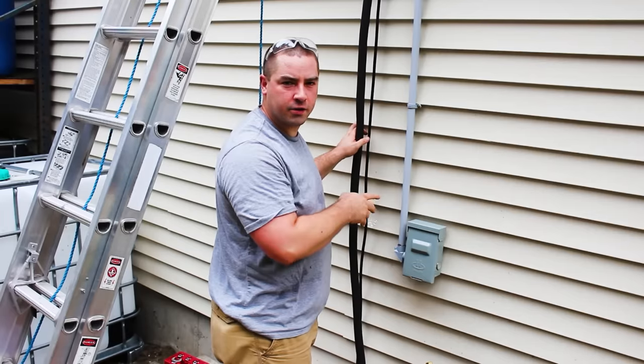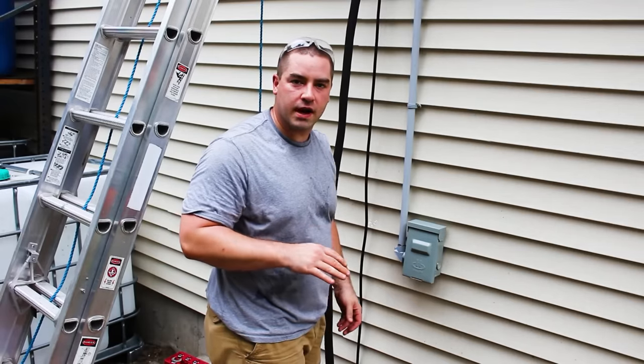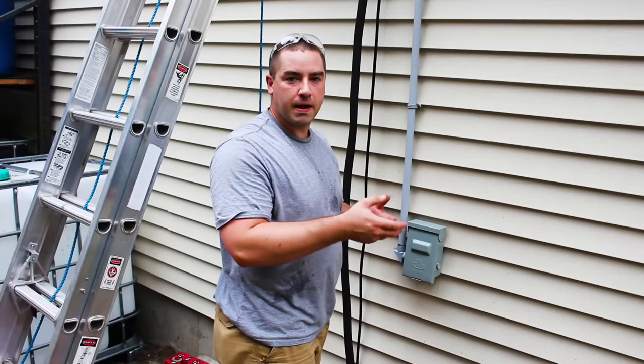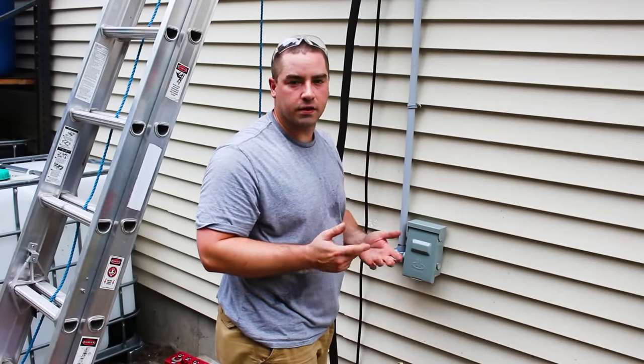That's one tube down. Now I'm gonna go up and do the second one. The second one is a 1/4 inch, so it's gonna have a different torque setting. Again, I'm gonna refer to the manual, and I'm going to tighten it up to the lowest, back it off a little bit, then bring it up a little bit higher and torque it down for the last time.